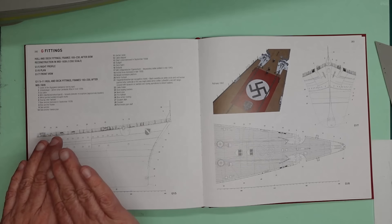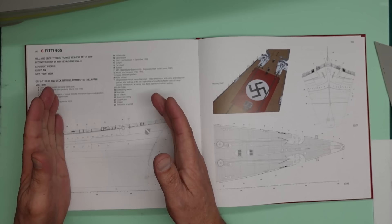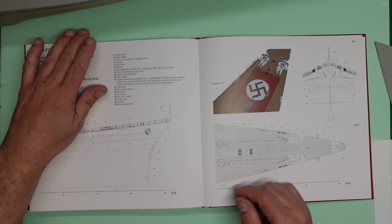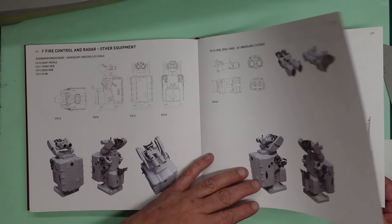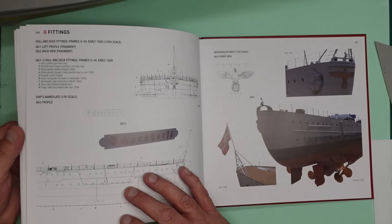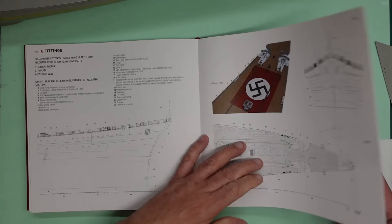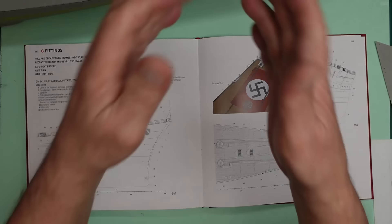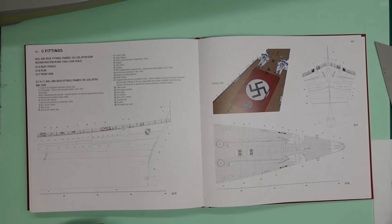I've made a paper template of that area so I can get a rough idea of how it's got to go. Remember when you look at these drawings they are kind of flat - it's almost as though you're working from the centre line of the ship. When you look at the distance from the front edge to the stem it's 61 millimetres if you measure flat, but if you roll the tape around the hull it's more like 65 millimetres - so be very careful. It's the same when you see a drawing of the stern: you see the bow in the background, whereas in reality it would be a tiny dot due to the focal distance. They draw it all flat on the sheet of paper, so be wary of that.